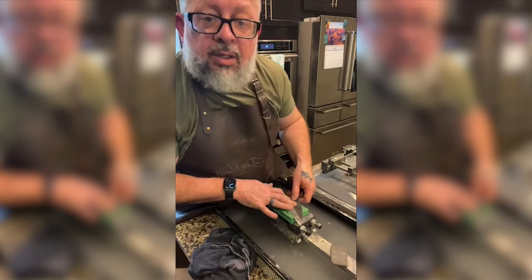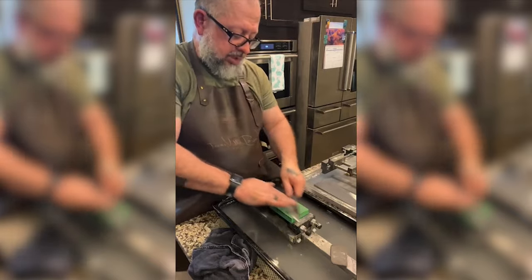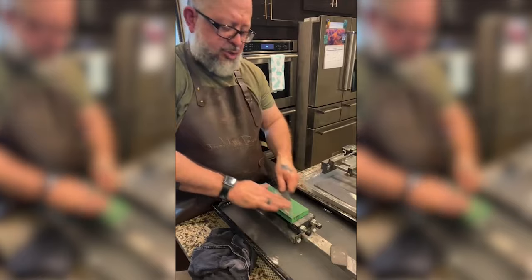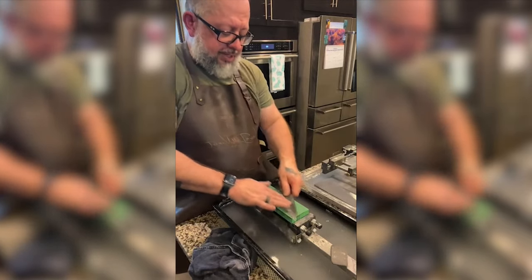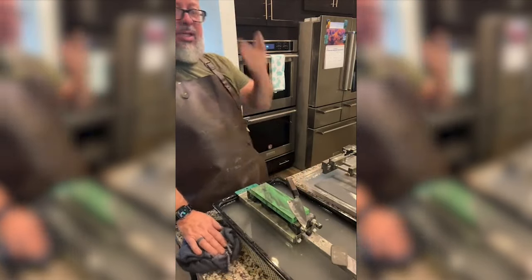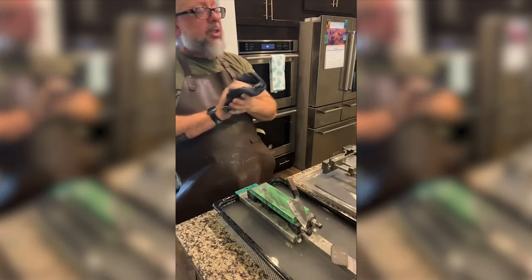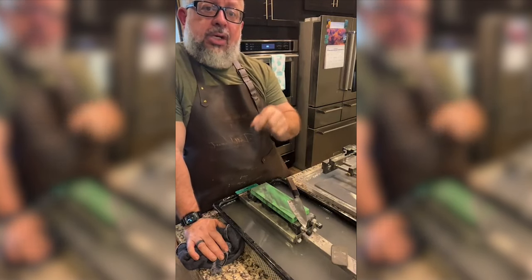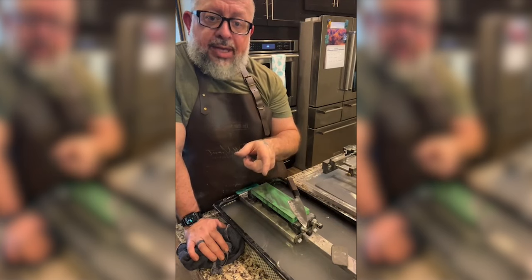Yes. Perfect apex. There's a big argument out there that I don't like, and the argument is toothy edge over a refined edge. Studies have shown that if you have a toothy edge, and that's microscopic, you're going to pierce the skin of the tomato, you're going to cut fatty food. But teeth pick out, and knife grinders' research shows that when the teeth fall out, it creates a pit in your edge.